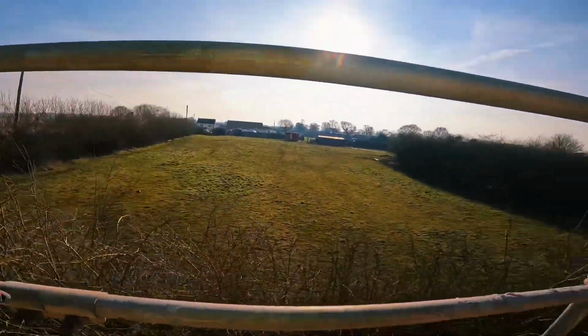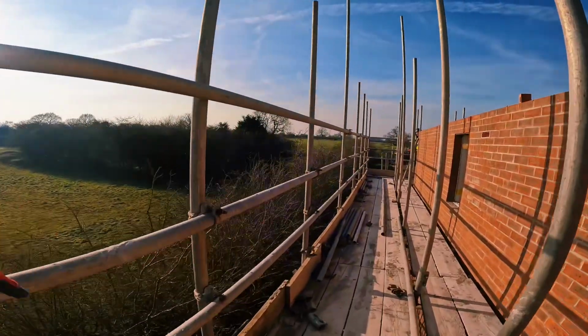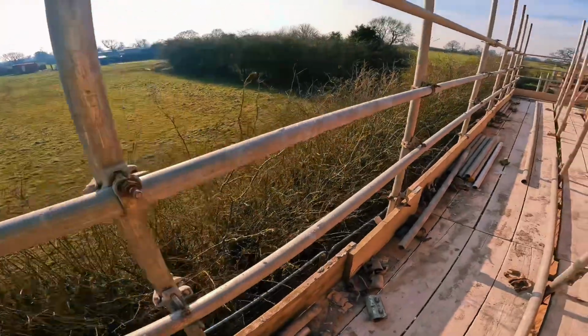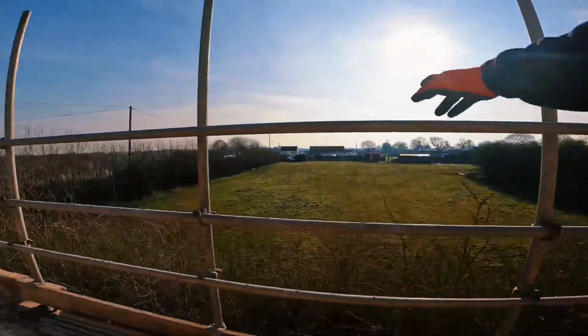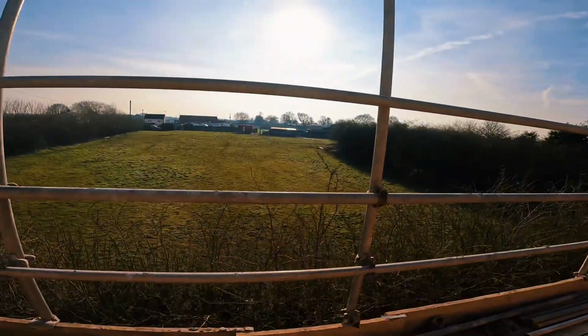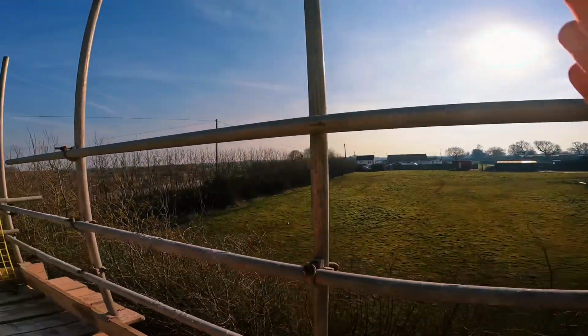Now my butt will go this end. Like I say, this is not your ledger, it's a handrail. We go off the ledgers that are underneath the boards. Install all the doubles on here first, sleeve that straight up, then stagger this ledger backwards into this bay. Off we go. Let's have ya.